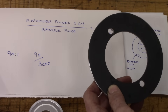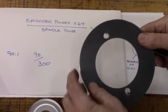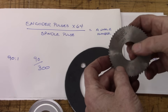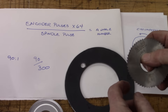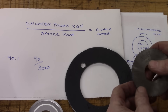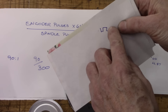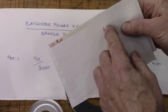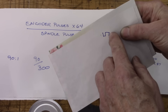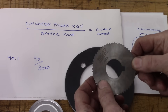The reason I went with 300 is because I have a bunch of saws, but this is the only one that works out right for this circumference. This circumference is 15 inches, and if you multiply 0.025 by 600, that equals 15 inches. The reason I went with 600 is because you've got to count both the notches and the solid parts — so it's going to cut 300 slots but it's 600 divisions. So hopefully I did that right.